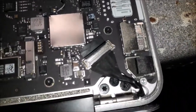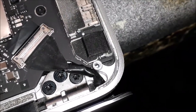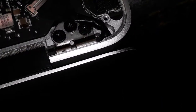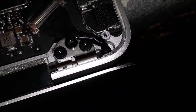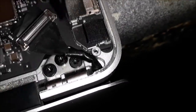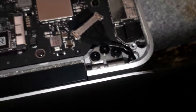And then you guys ask me, why do I put the black tape there? Why? You see over there, the metal on the body. That cable keeps scratching on the metal. And then, by the time, the cable starts to get ripped off, short, and the cable breaks. And sometimes it also breaks the LED driver, opens the fuse and breaks the LED driver. So that's why I put the plastic over there, to prolong the time, you know what I mean? So it will take much longer for this cable to start snapping. That's why I put the black tape over there.